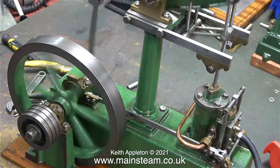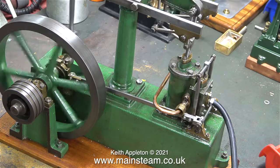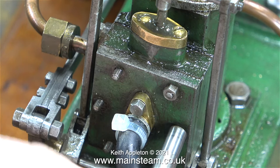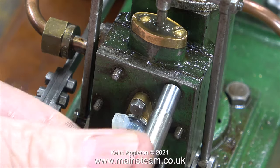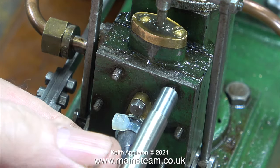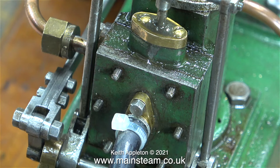As you look at it now it sort of looks okay, but in certain areas it is far from okay. This is an old engine and some parts of the engineering are a little bit suspect, so I can't claim I can get it to run magnificently — but I'll get it running quite well and quietly. It's time to remove the steam chest cover. I've edited the nut removal to speed things up. Here you see a typical example of the law that says the last part of the job goes wrong — I could not shake the nut out of the nut spinner, which is why I refitted it to the stud to remove it by hand.